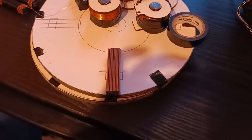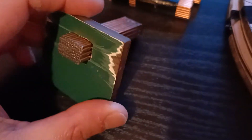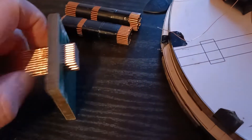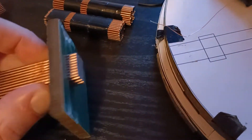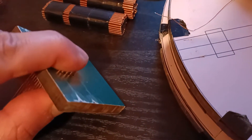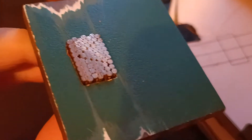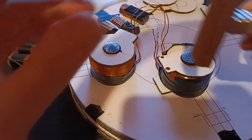You basically put the rods in the edges like that. The longer end goes here — make sure it's on the edge. This makes it easier for the handsaw to cut straight. And as you can see, all of them end up the same length.